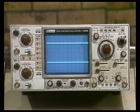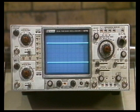Two of the channels — channel 1 and channel 2 — have a full attenuator, and channel 3 and channel 4 can be addressed via the A and B external trigger inputs. It does have some very important features missing. For instance, there is no beam find available to locate the trace on the screen. The triggers are position-dependent, which means that once you reposition your waveform, the triggers go away. There is also no line trigger available.